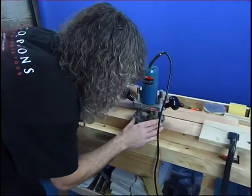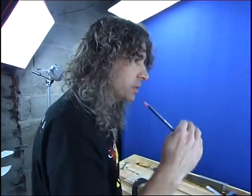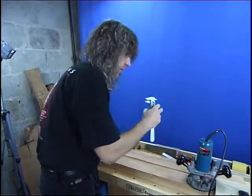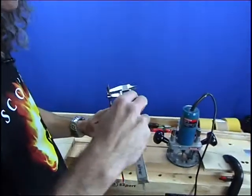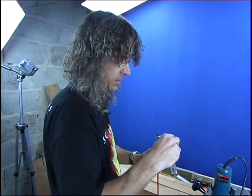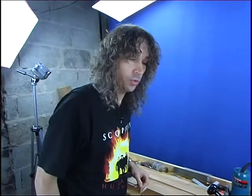I'm going to run along there and come to here — we're going to line up and stop there, that's perfect. We're going to do this in a few passes, and each time we drop the depth of the router a little bit. We need a depth of 11 millimetres. So we need to get our safety spectacles on and then we can start some work.